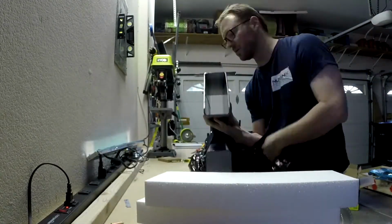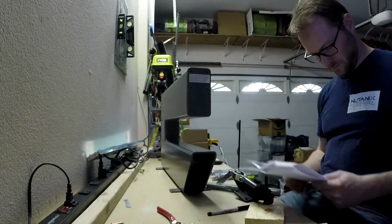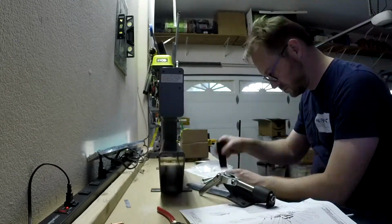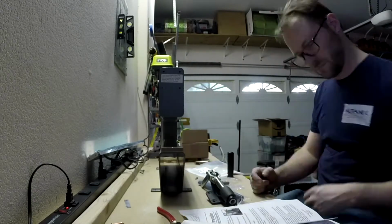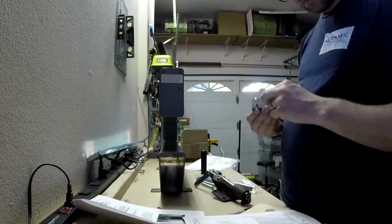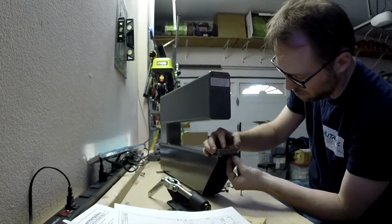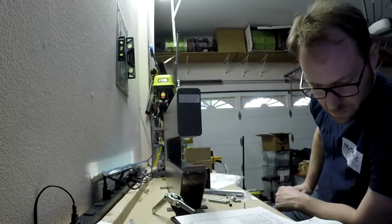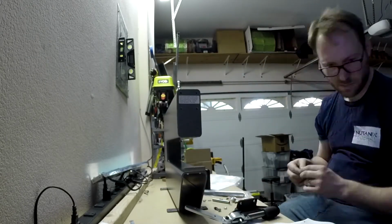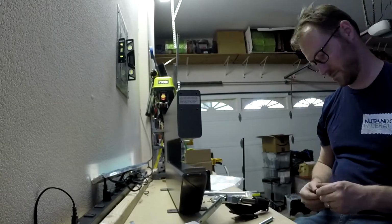Oh, and here we're going to build the DRDT2. This is a dimpling tool. It's very useful for dimpling skins, where the hand dimpler can only really do the edges. Even the pneumatic squeezer only has a reach of about 3 inches with a 3-inch yoke on it. This has, I don't know, what, a 24-inch depth. So anyway, it's very useful for dimpling skins. It's also pretty quiet, so I can dimple at night when kids are going to bed and stuff.